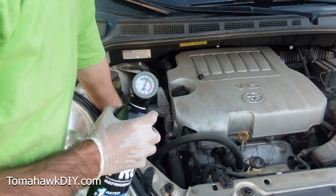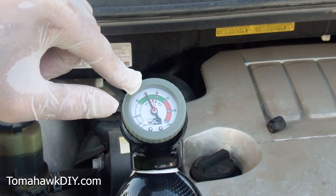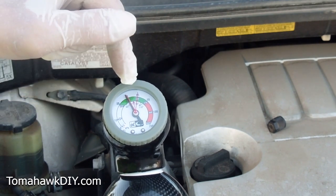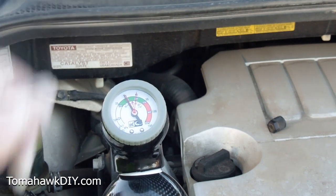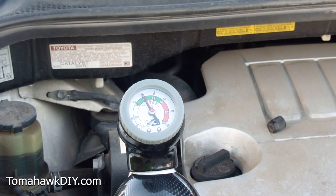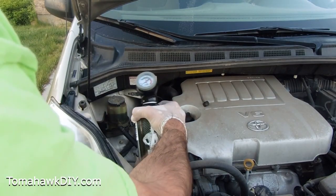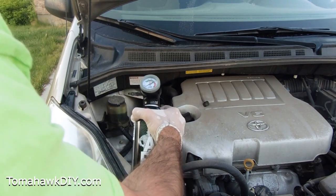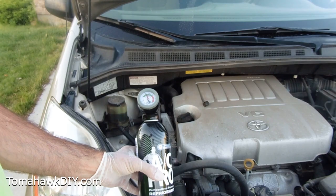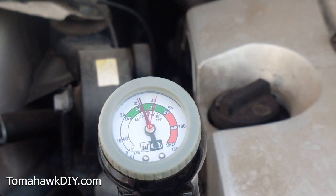Let's reconnect this thing. My gauge is showing the black line and the red line are right together at the low red line. We want to get it up in the middle between the V on the high and low. Remember, we've got this set at the outside temperature. Let's squeeze the trigger and turn it again — squeezing the trigger, rotate, shake a little bit, rotate, shake a little bit. The black gauge line is just inside the red line, so we're getting really close.